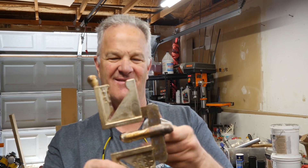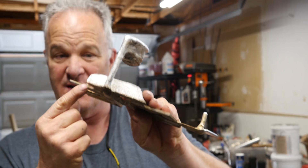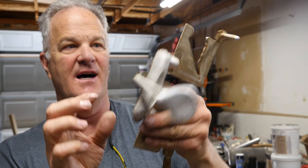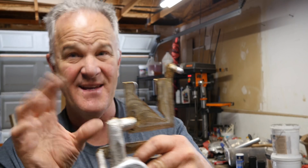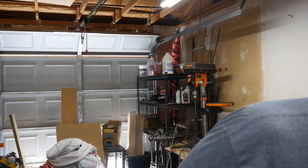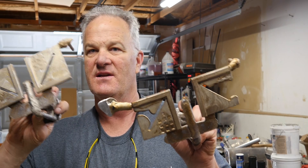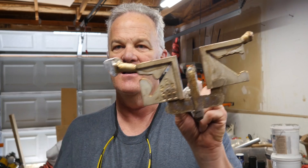This is the one I did last night — pour three. Failure on this part. You see where I gated in — I gated into this really thin part of the part. That's where the gate comes in and I think that's my problem. I just didn't get enough material in here; it got cold and froze up. Comparing that to the one that worked — I gated into the thick part. The one that didn't work — I gated into the thin part. That's the difference, and I have a feeling that was the huge difference.